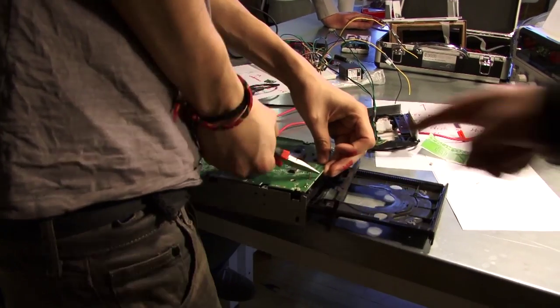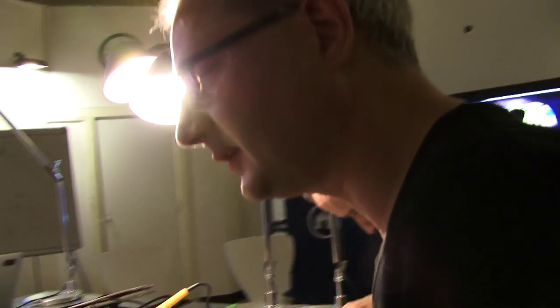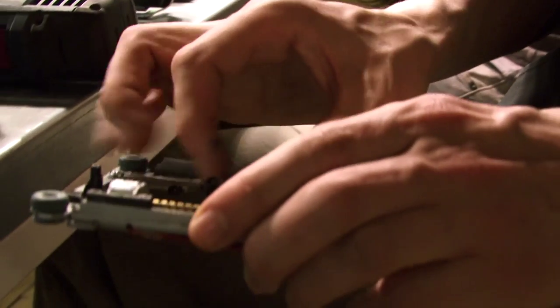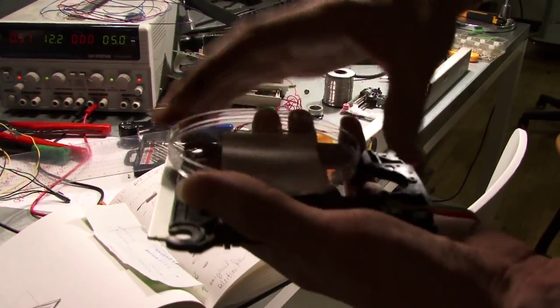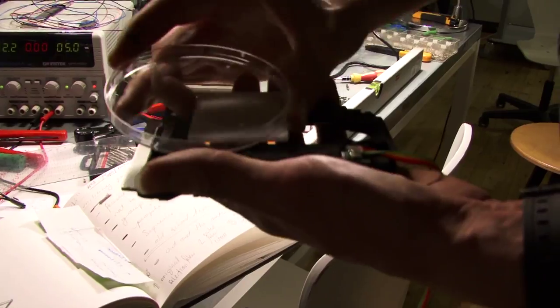I'm going to cut the red wire first. This is the optical part of the CD player — the lens there. What we need from this is the stepper motor. There are other drivers as well, but they use DC motors, so you can't use them. We specifically need steppers. If we place it like that, we can very easily move the whole thing back and forth.